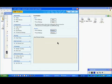There is also a second advantage, when you have a location with multiple printers. You just concentrate on setting one printer with your customer, and again the colors he wishes, how you want to print the UV, the inhibitor, and so on. When everything is okay, save them, driver and printer. Now retrieve them from here, put them on a USB pen drive. Now you go to the next PC and the third PC and so on, and you just restore them from your USB key, and automatically the second printer, third printer and so on will have exactly the same parameters as the first one. So that saves you from doing the job X times. If you have X printers, you just do the job once, and after you repeat everything everywhere.